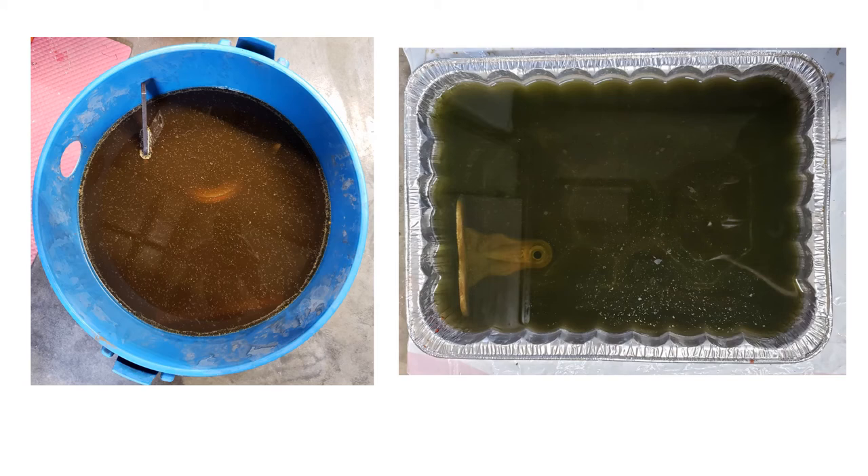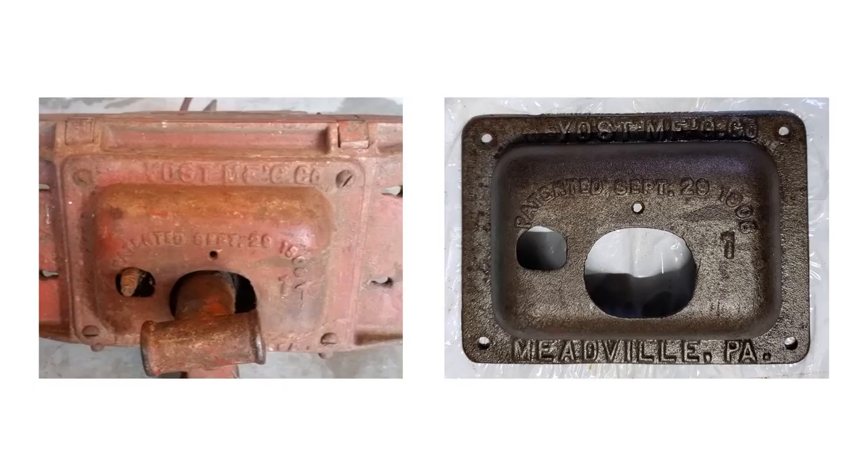The large parts were soaked in the tank of a non-functioning 12 gallon shop vac, and smaller parts were soaked in various containers. The screw vise, being especially long, was immersed in Mean Green poured into a sealed piece of 1.5-inch diameter PVC pipe. The parts were soaked anywhere from 12 hours to several days. Unlike some rust removal methods, there appeared to be no ill effect from leaving the parts in the Mean Green for an extended period. Some parts needed extra treatment with a small brass cleaning brush, but for the most part the parts were ready to paint immediately upon drying.